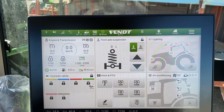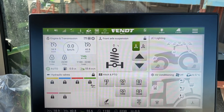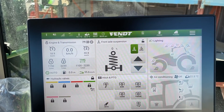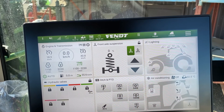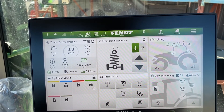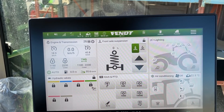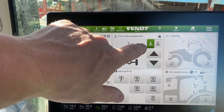As you can see, currently the front axle suspension is unlocked. Unlocked is the setting for when you're doing fieldwork with the tractor — basically anything as long as you're not carrying a heavy load on the front end loader. It is recommended that if you have a heavy load on the front end loader, you lock the suspension, as it's probably going to be bottomed out anyways and it will just be fighting itself.